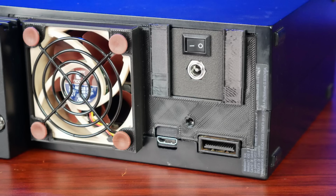And the HDMI port on the back is unfortunately the mini HDMI. I prefer a full-sized HDMI plug, and the only one I feel like I've done that went that route was for the PlayStation 1 system, but I had to break off an entire port to make that happen. So I know that there are space constraints. That's just one unfortunate drawback: I'm using not only a barrel plug for the power supply, I'm also using a mini HDMI. So this system is basically traveling with those two cords if I have to take it anywhere.